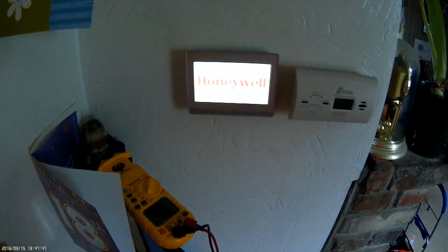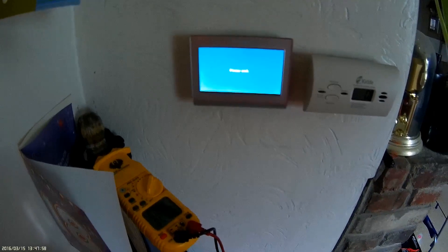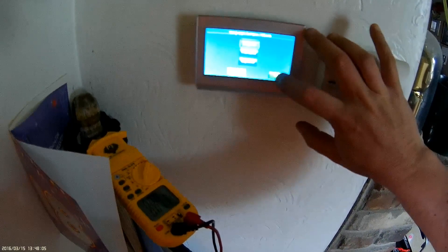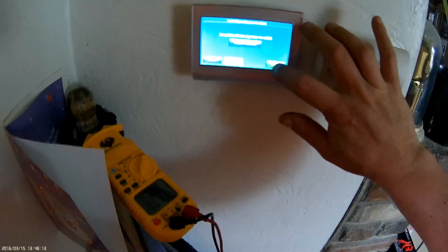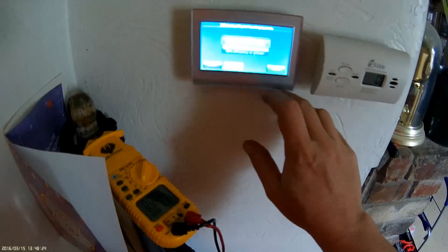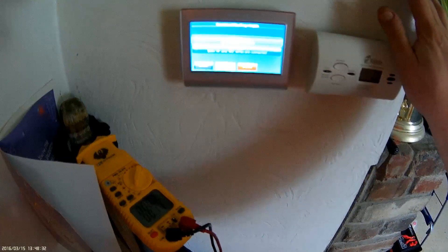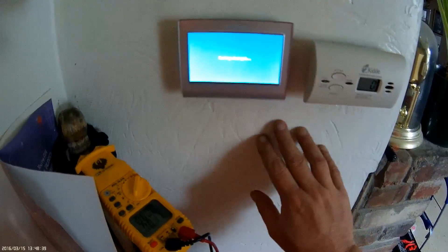Warming up, I take it. Please wait — it's going to take us through the setup. We'll tap English, it's already selected. Next. Home — location name: Thermostat, we'll leave that. Cooling and heating — yes, it's both. Forced air — yes, it is. Gas — yes, it's gas. Standard efficiency, less than 90% — yes, it is. Single stage. W wire is connected — yes, it is, it just verified that. Done. Saving changes.